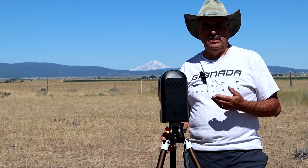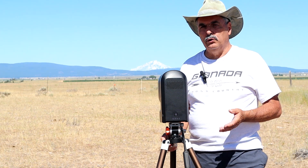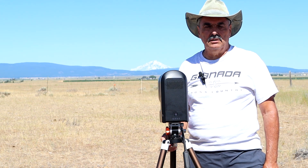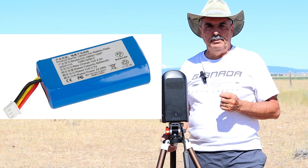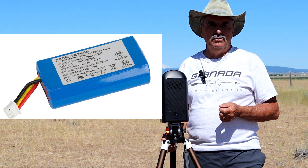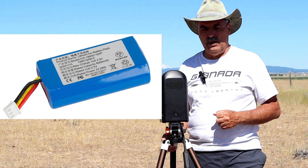The spec on the battery is 6 amp hours or 22.2 watt hours, so it's rated for about 6 hours. It consists of two cells in parallel, each cell at 3.7 volts nominal. By being in parallel, each cell is a 3 amp hour cell at 3.7 volts, so by putting two in parallel, you get the 6 amp hour capacity — 22.2 total watt hours of capacity.